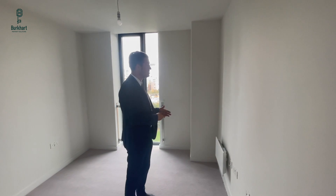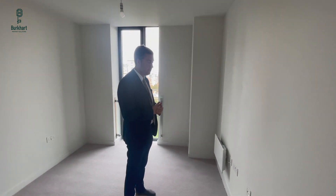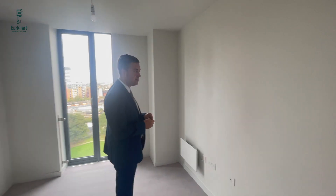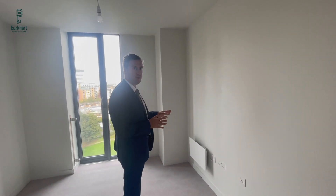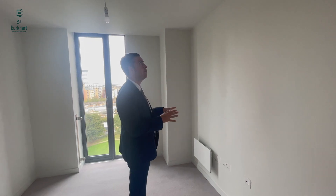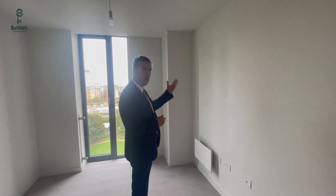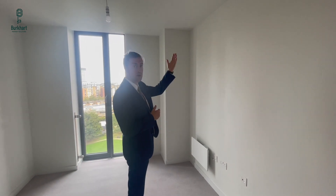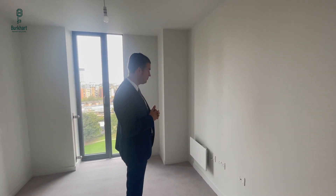Because it's plasterboard and there's so much moisture in the building process, there's a drying out period of 12 months. We recommend not to do any decorating or wallpapering — especially wallpapering, but also paint — just leave it for the first year. If you start wallpapering, you could be trapping the moisture behind the paper that's trying to get out.